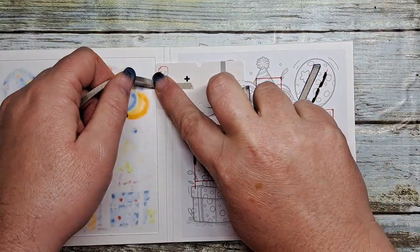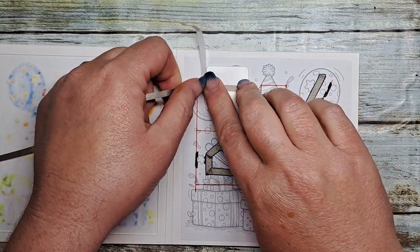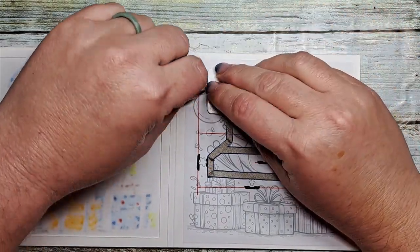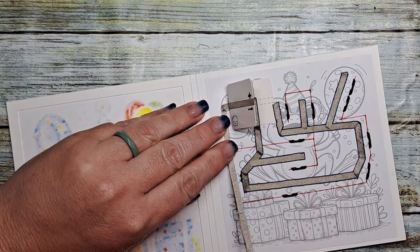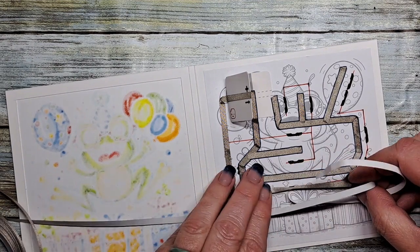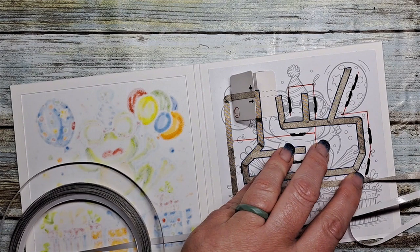Let's work on the positive side. We're going to start on the inside of our battery holder, because that flap is actually going to touch the top of our battery, which will make the switch turn on once it's pressed. So it's very important to start on the inside as indicated by our battery holder. We're just going to follow that red line all the way around our circuit.